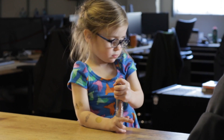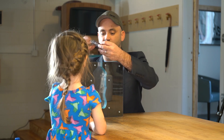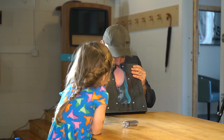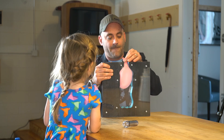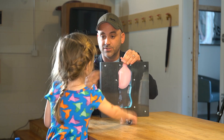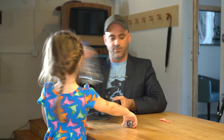And then what we do is we take a mold like this, and we make that thing nice and hot and then we put that thing in here and blow it. So we take this thing, make it hot, and we blow it up like a balloon inside of this mold, and then you take it out. The mold opens up and you take out the part.